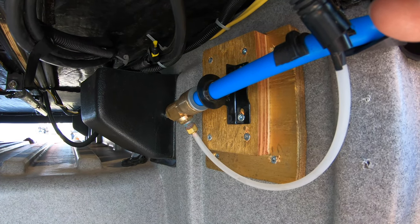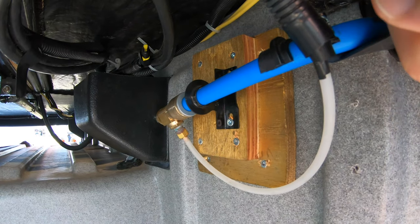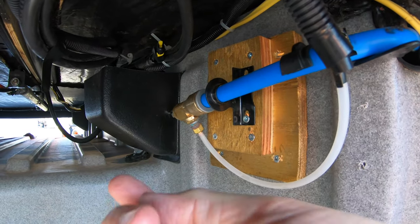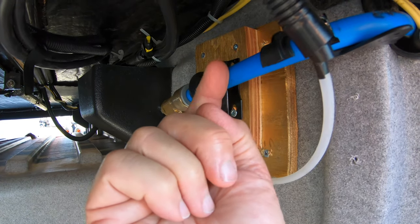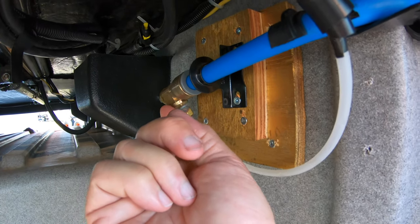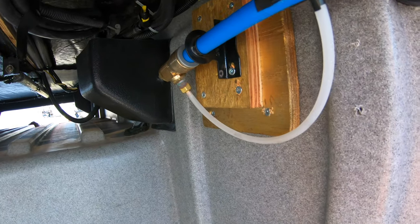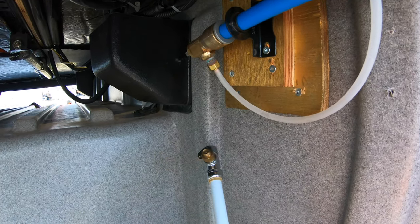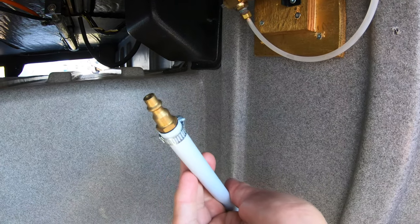Where I am right now is where my fridge connects to my water system, and it's this line right here. I've also got a valve right here that I've turned off, so there's maybe plumber's antifreeze in here, but it doesn't go past into here. And now I'm going to take this off right here, and I'm going to connect it to my adapter that I made. It's the same fitting right there. And this part here hooks onto my air system.